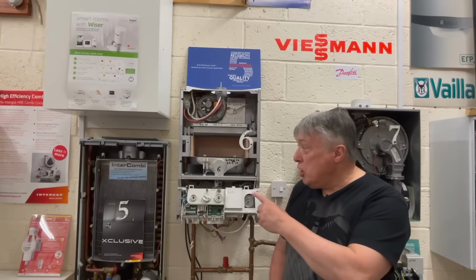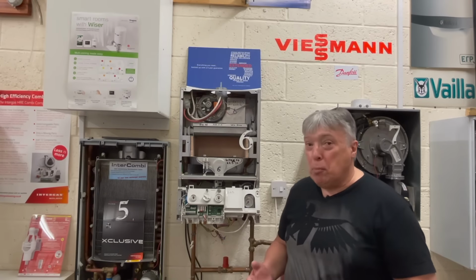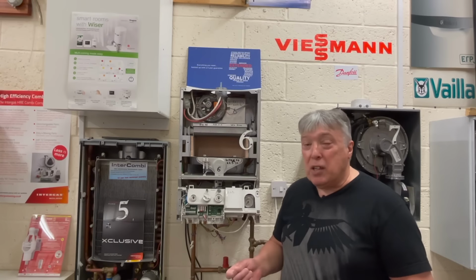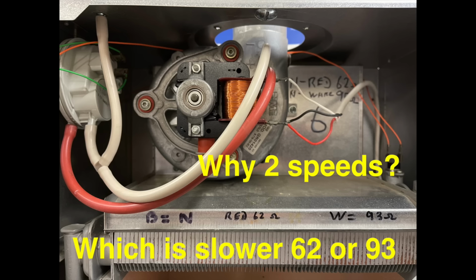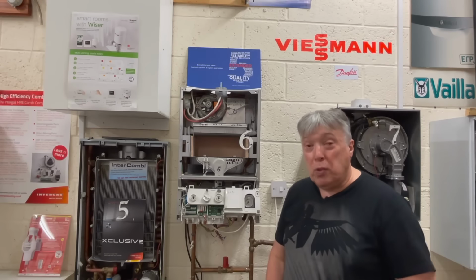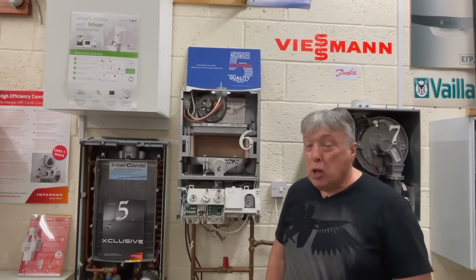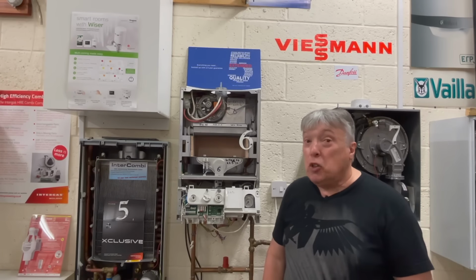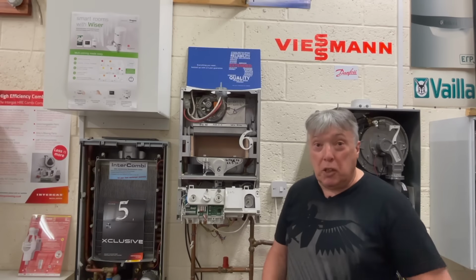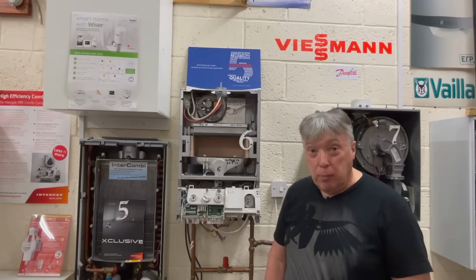So we've got a spare one that we can zoom off, and that's how we interchange parts as a temporary measure. Here's a really good example of a manufacturer, Worcester, who's taken the time and trouble not to fit just a standard single speed, but two speeds. So what's the advantage? As we can see on the cutaway, there's a really good reason. So the question is, is it for modulating in hot water? A lot of people say that, and they could be right. Does it modulate in central heating mode? That sounds logical, because that's cheaper to run. But the answer is, it's a time delay.